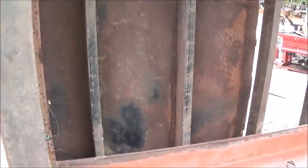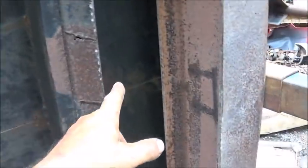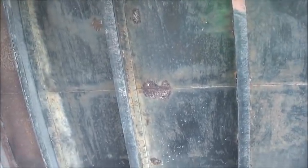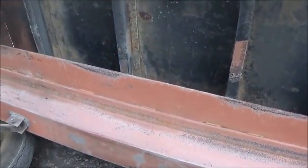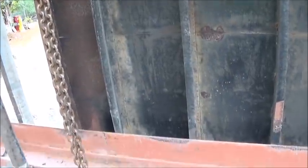We ran out of oxygen, but we got a lot of this off by burning the welds. Found out this cross member is not mounted well — not even on the other side. What I think happened is this was originally a car trailer and they put these i-beams under it, then set the old frame down on top without welding the beams in properly. The reason I think it was a car trailer is because of the tongue — there used to be one there and it's gone. It was a bumper-pull trailer and somebody put these i-beams under it and built a new tongue, which is fine.